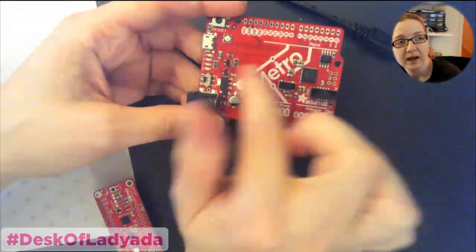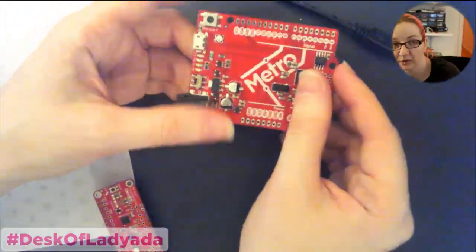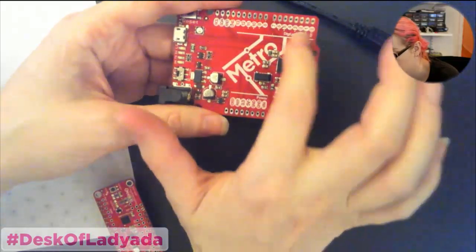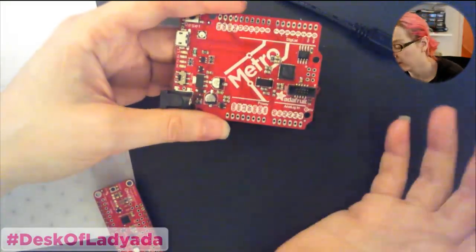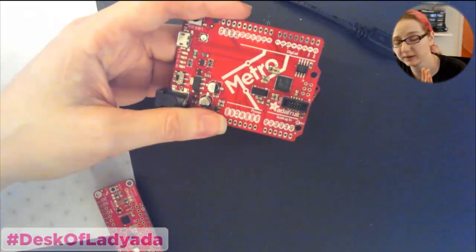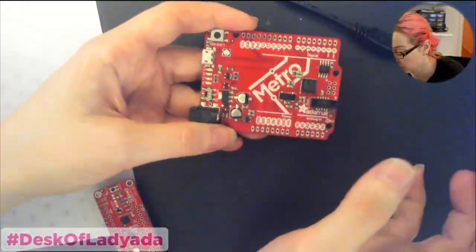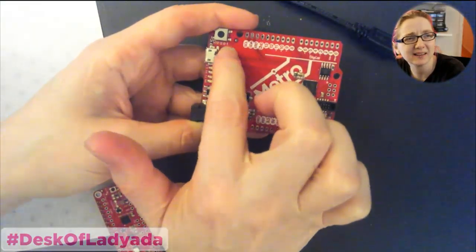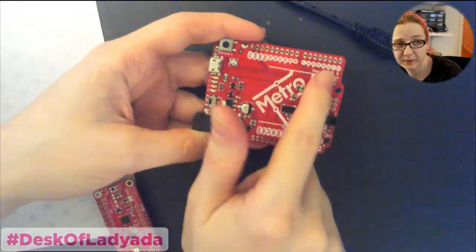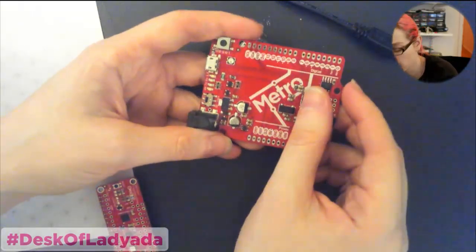This is our board for MicroPython. The reason we went with mass storage is it makes it really easy to put code and get files off the processor, instead of transferring files through a REPL or an SD card, which can be a little expensive and delicate. This is where you store your data, because Python is an interpreted language — you just drag a Python file on there and it executes. Very different way of doing development than Arduino, but you can also use it with Arduino; the bootloader works with Arduino. We're going to probably ship it with MicroPython on it. We also added a little NeoPixel LED — a status LED — so we can communicate to the user when we're writing to the SPI flash, executing main.py, or when the REPL is open.